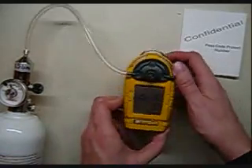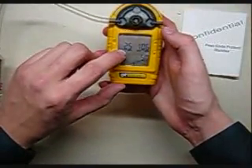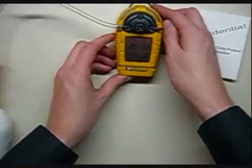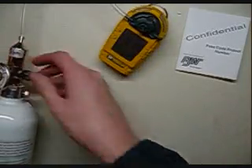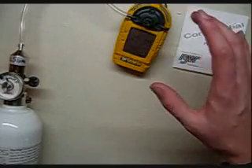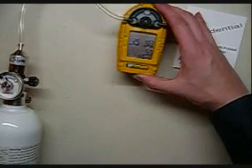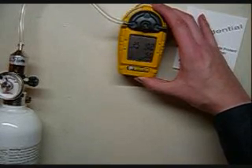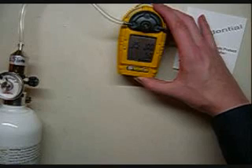Now while it's calibrating, you're going to notice some numbers bouncing around. The computer will automatically set everything down to 25 for H2S, 100 for CO, and 50 for the LEL. This unit does calibrate to 50% LEL methane, or 2.5% by volume. One thing you'll notice about this monitor is it does take quite a bit of time to calibrate, so make sure you have plenty of gas in the cylinder first — you don't want to run out of gas in the middle of the calibration.